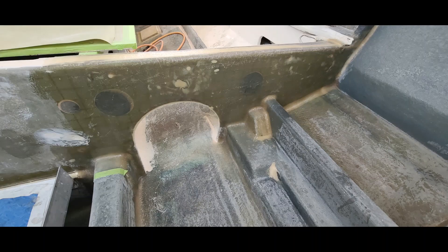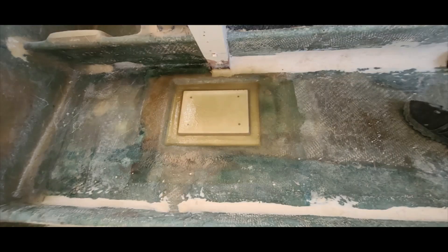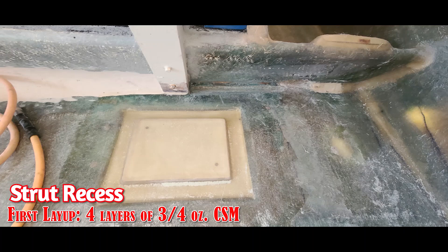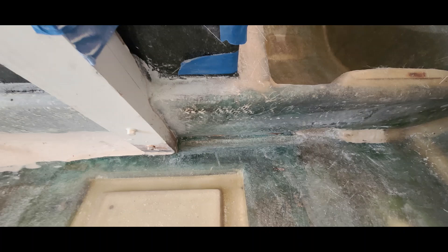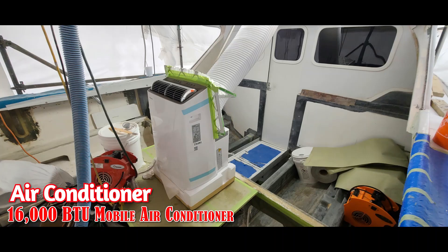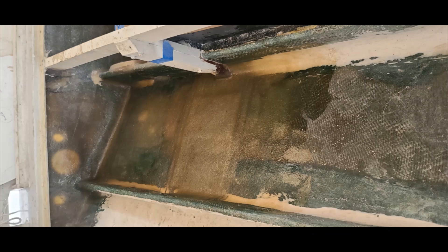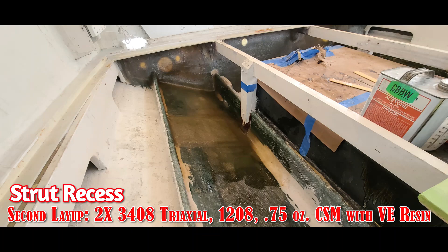This is back to the rear bulkhead. We removed all the gel coat — this was a molded bulkhead that came from a company in Miami and they installed it. There's a crack right there where the stringer meets the hull, and we ground that out. It will get rebuilt with 1708. This is a Toshiba 16,000 BTU air conditioner keeping us cool. And this is the rear bulkhead completely laminated with 1208 and three quarter ounce mat. This is the first strut layup — the real hefty layup stuff. We did two layers of 3408, finished that with a 1208, and then a 17 ounce chop strand mat over top with vinyl ester resin.